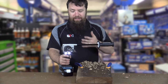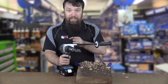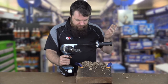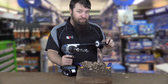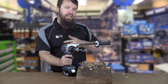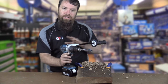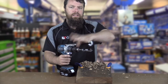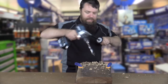The machine obviously in second gear, which is what you shouldn't do at high speed, is going to overheat and it's going to cut out so you can't break it. Then I've just flicked it straight into first gear, or the gear that I should be using, and it's ploughed through however many holes into hardwood — not a problem, hasn't overheated. To me that's incredibly impressive. I haven't really seen another Makita drill that you could do that with or even try. But my personal spin on it is just click the clutch in, so that you're basically safeguarding your drill. That's all — just flick it from drill mode to screw mode, which if we lessen off the clutch, it's just going to clutch out. So I'm going to put the clutch in number 21, which is maximum, and I'll show you exactly what I'm talking about.